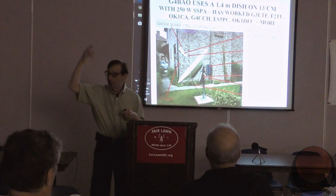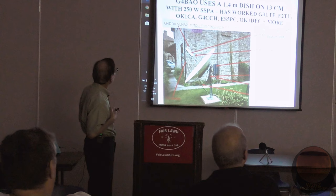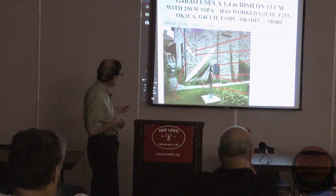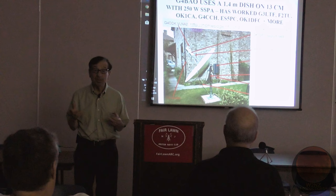So this is a fellow who feels he's very limited in his home. You can see it here, and he has a 1.4 meter dish. And this is an example of him on 13 centimeters. He uses this same dish on 1296. It's a little small, but he makes contacts on 9 centimeters, 3400, where I worked him just recently. And it's really not that fancy. He's got this mounted in concrete with a nice pole. But if you picture this, it's not a real mechanical effort to put something up. It's probably less than what a lot of you have invested in the tower in your backyard to get your antennas up in the air.